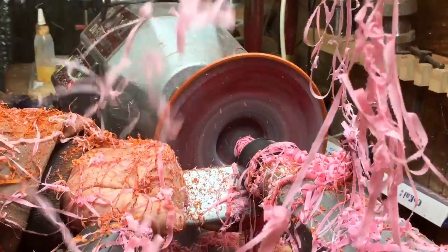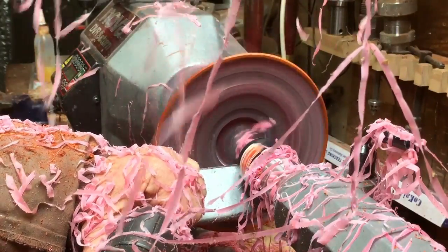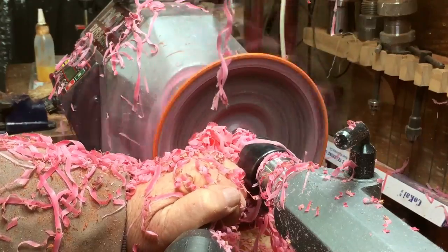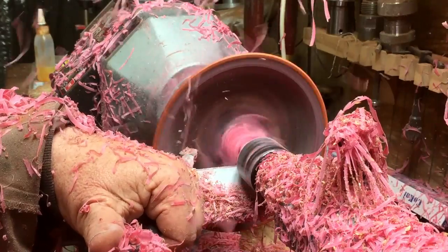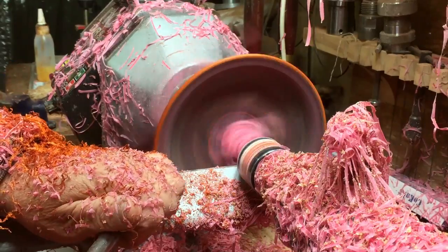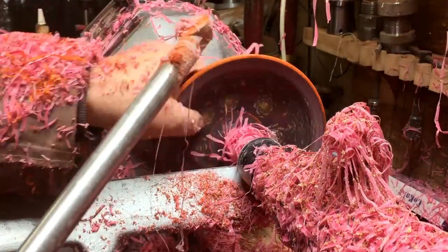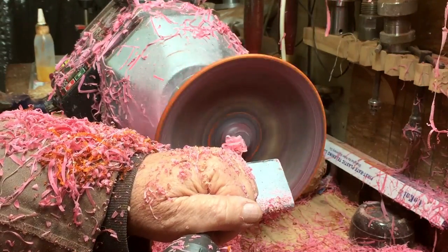Turning it around, I tighten it a little bit — not too tight because I don't want to damage the dovetail recess in the back, which I made very narrow because of the ball shape I wanted to create. Now I'm going to clean it up and give it the inside shape of the ball, leaving the support of the tailstock all the way to the end. If you look carefully in the middle you'll see a round line — that's part of the feature I mentioned. When I hollowed the inside of the padauk and left it as a cup, the cup shape creates something interesting.